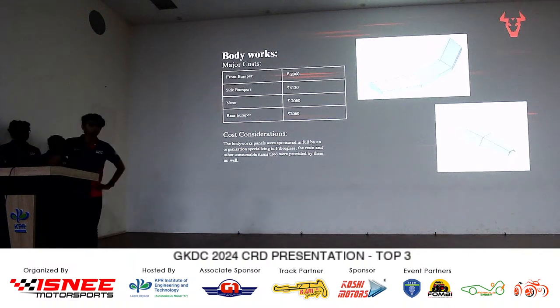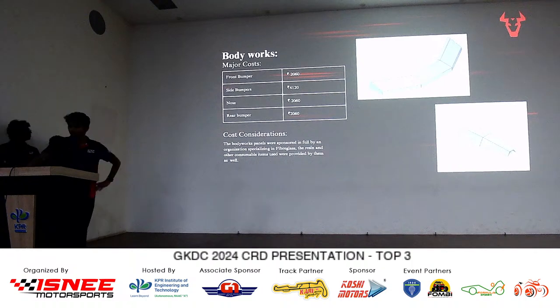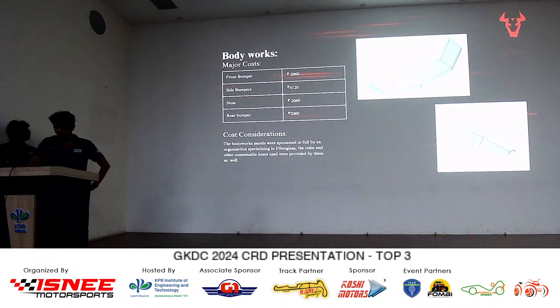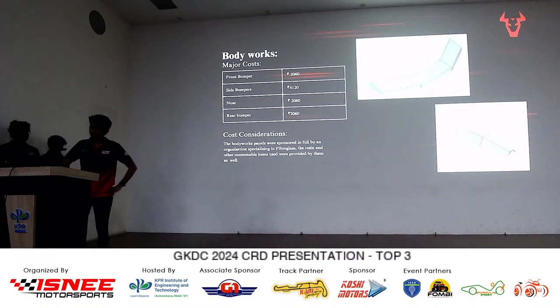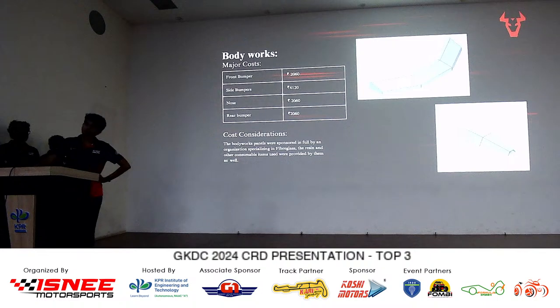Onto the bodywork on our go-kart, we've fabricated it using fiberglass. We've molded it on PU foam, which was quite a large cost here, especially for the mold. We use 60 GSM fibers to reduce the cost, and the resin. The resin was sponsored by a company called ICP India that helped us through the entire process of the design, molding, and all of that.